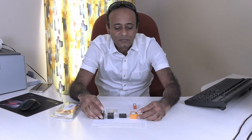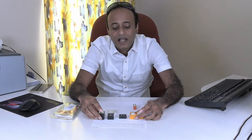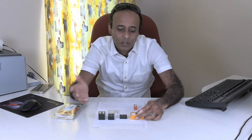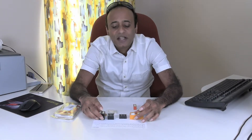As you can see here, there are a few relays. Relays come in different sizes, different form factors, different switching voltages, and with switches of different voltage and current ratings. They come with single pole, double pole, or more than two poles, and also with single throw and double throw. Relays may also have more than one switch. Commonly available relays in the market are referred to as mono-stable relays.